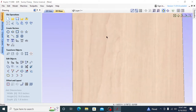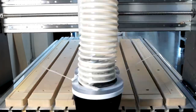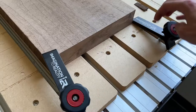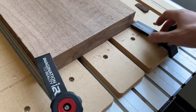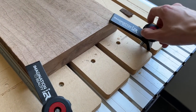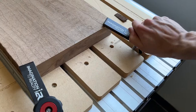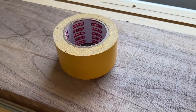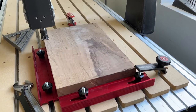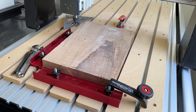Once that's squared away, save your toolpath to your computer and head over to the machine. Best practice for this cut is to make sure you have a surfaced machine bed — if you haven't done that yet, we have a tutorial video on how to do that linked below. For this cut, hold-down methods can get a little tricky. If you have excess material that you plan to trim off later that the bit won't come in contact with, you can use hold-down clamps on those sections. Otherwise, you can't have any obstruction on your surface. A couple of options would be either double-sided tape, which can sometimes be risky if not done correctly, or linear clamps with side compression. I'm using the linear clamp method, and if you don't have a set of these, there are great resources online for making your own right angle jig for your CNC.